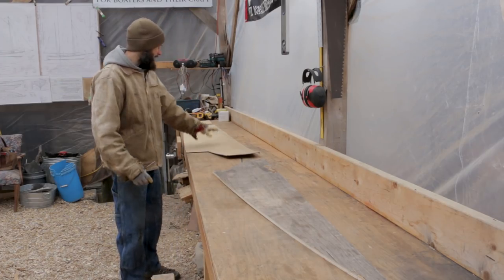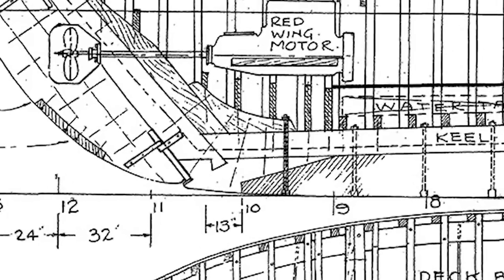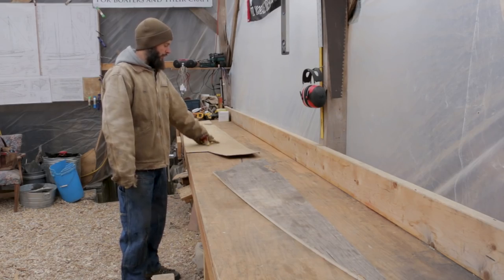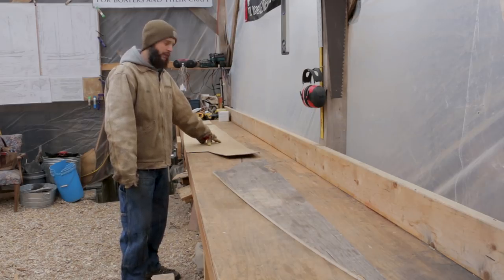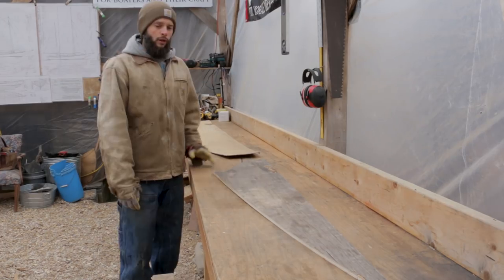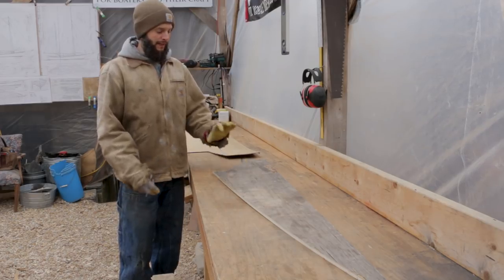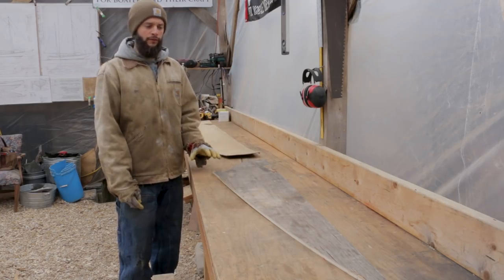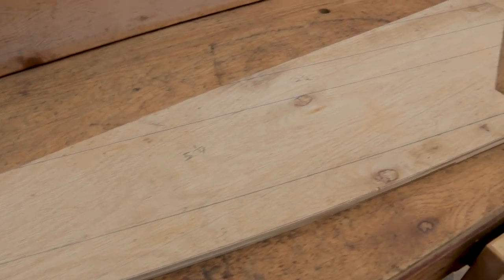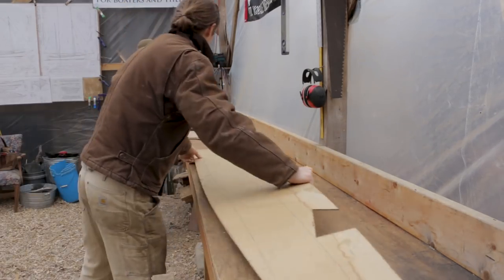The aft pattern is even bigger and a bit more structural. The stern timber ends up coming into basically a mortise in the end, and that is an actual structural piece of the boat. So the aft one's a little more of a concern, but we're still going to do the lamination — otherwise it would be a massive timber to cut this out of. When laminating a big timber like this, one common term is 'lifts' — basically each layer that gets glued up. I drew in the lifts on the other side of these so we could figure out how much timber we needed and what size.